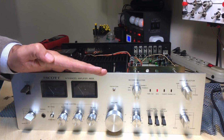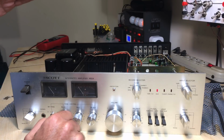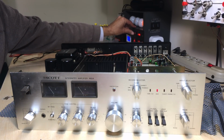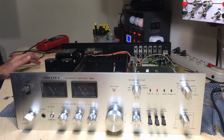And one more thing I noticed is that little bulb is on, that one's off. There, it's gone into protection again. It's clicking on and off protection. It could be because that thing's drawing 140 milliamps, so it's seeing 178 volts. Let me give it one more light bulb. Now it's really clicking away.